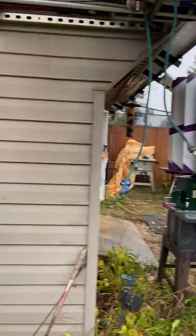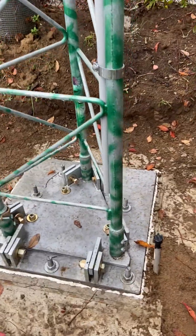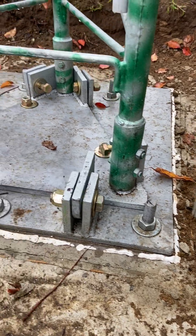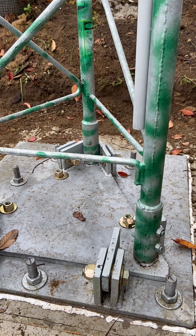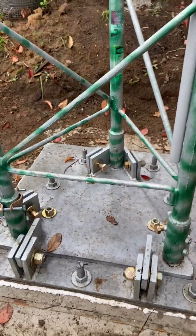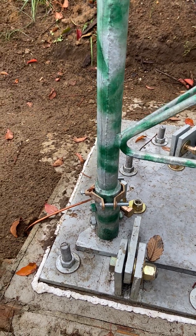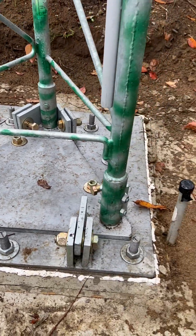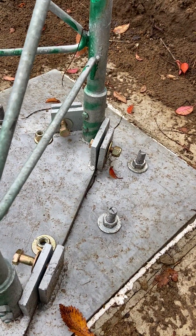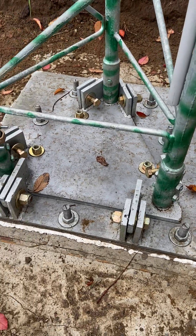The top plate is quarter-inch steel. For the bottom plate — Cheryl out at Harmony Turbines was asking about this — I had to fabricate it myself. It's basically half-inch steel plate, 25 by 25 inches, with inside triangles 19 by 19 to match up the Series 55 tower from Anemoi right out of Shelby, Ohio. Then three-quarter-inch J-bolts go down into the concrete three feet, with grounding rods and grounding wire buried eight inches below surface, three-quarter-inch hardened bolts for the tilt, and five-eighths bolts for holding the plate down. That plate and triangle was another $550.